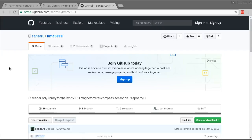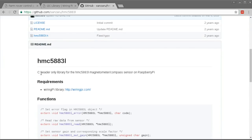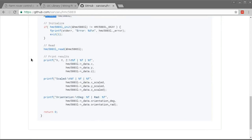I didn't use WiringPi directly with the compass because I found another useful resource - an HMC5883 compass convenience header-only library. It lets you declare a compass variable, initialize it, do a read, and it handles all the annoying calculations of scaling the values so you get the orientation in degrees and radians. I actually didn't use that output directly because I wanted to use my own calibrated values, so I copied source code from my return-to-home radio control car project. I read compass values for 20 seconds while turning the wheelchair around, then stored the average, min, and max to a file for calibration.